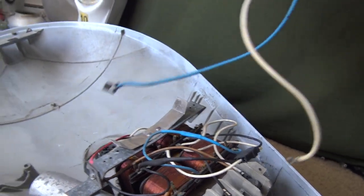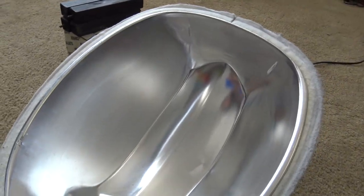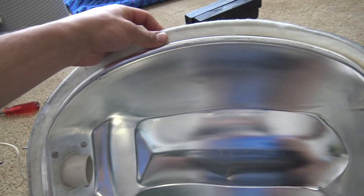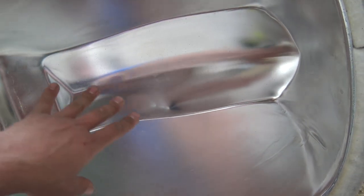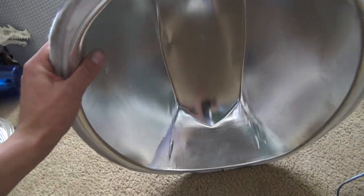There you go — now you can take it out and inspect it. Let's look at this reflector. It is very, very big. Luckily this one hadn't had a mercury lamp explode in it — when mercury lamps explode, all that phosphor gets on the refractors, and then moisture gets inside, hardens back up, and permanently sticks making it foggy. I'm glad this one's clean and clear. Overall it's a very durable refractor. The socket is connected directly to the reflector here, and you can see some room for adjustment — three spots — so you can pivot the bulb up and down depending on what kind of light optics you want.